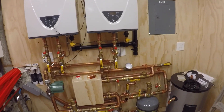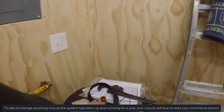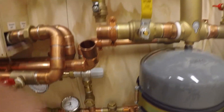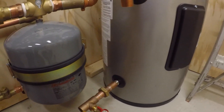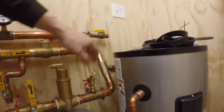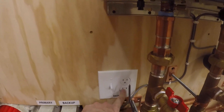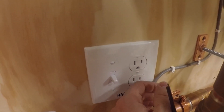So that's where I'm at. If you see anything that jumps out to you, please let me know. The top of the tank here will be an inlet. This will be my hot water outlet — this will come down and go back to the wall over there and feed into the hot side of the mixing valve. Down here, this will be cold water fill, it'll be for flushing. I'll have a ball valve on it, I can shut that off, shut off the incoming water, and I can flush the tank. As far as controls, each of these switches — the bottom outlet is switched, and as you can see when it's on it's blue and I can control these from my smartphone.